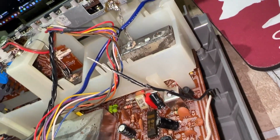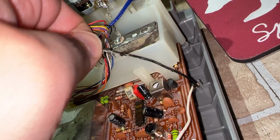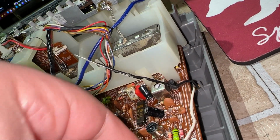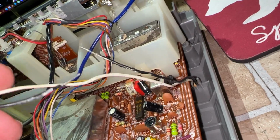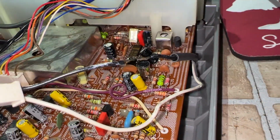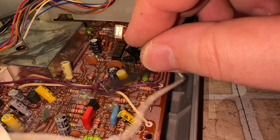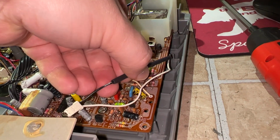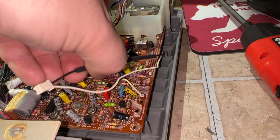Now this right here, I forget what wire that was for. Had to do voiceover on this one, but I had to splice it, resolder it, and put heat shrink over top, so I was able to save it at least. And that was a little tough getting that on there. But yeah, if the conductors were fine, I left it alone. I just cleaned the wiring up.